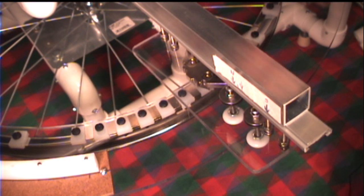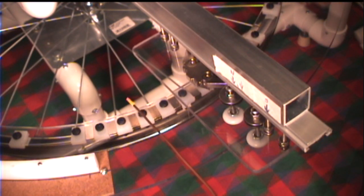I'm going to point out some of the elements that we're actually looking at, and you'll have a better description of them that way. You can see right here where I'm pointing — this is the one inch square aluminum extrusion, and that is mounted to a board which is mounted to the PVC framework. It's adjusted at an angle that matches the slope of the wheel rim — about an 8 degree angle.